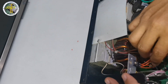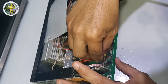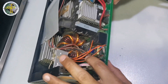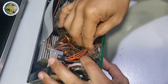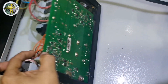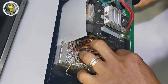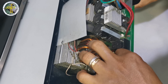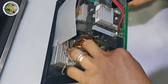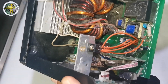Let's connect the five wires now. Connect pin 1 of the STRW6053N to pins 6, 7, 8 of the SD6835. Pin 3 of STRW6053N to pin 2 of SD6835. Pin 4 of STRW6053N to pin 3 of SD6835. Pins 5 and 7 of STRW6053N to pin 1 of SD6835. Pin 6 of STRW6053N to pin 4 of SD6835.